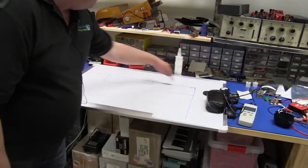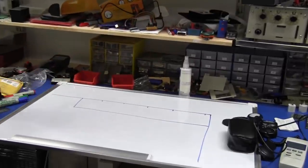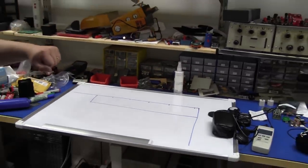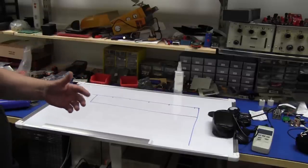What I figured we'd do is baseline what you've got on the bench at the moment. I've drawn a mud map here of your side wall, back wall, bench, and the positions of these verticals, just so we know what positions we've done lux measurements at. We'll do befores and afters. Before and after.